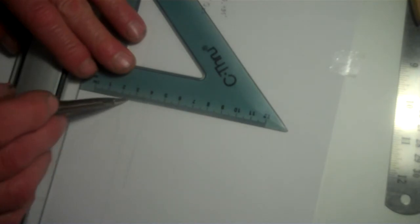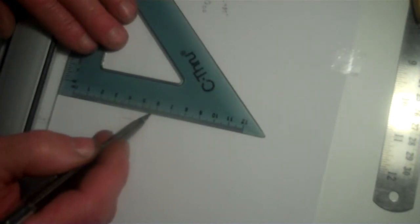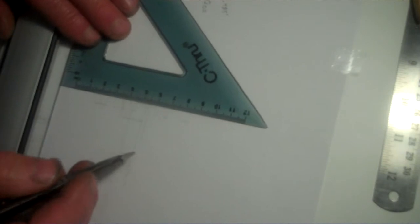Okay, so I'm going to come down below here, so I'll just go ahead and draw that in below. Then I also want the shaft to come up to here with a flange. I'll come up about 1/8 inch past that. So now 1/8 of an inch past the top here. And then the diameter of this here now has to be that inside diameter here. Then I'll just make this flange about 1/8 of an inch in thickness. It can be anything it wants to be. There's no problem there. And then I will bring this down now to 3/8 of an inch to fit inside the tailstock. So there's a center line. And then I'll come down to 3/8 of an inch.